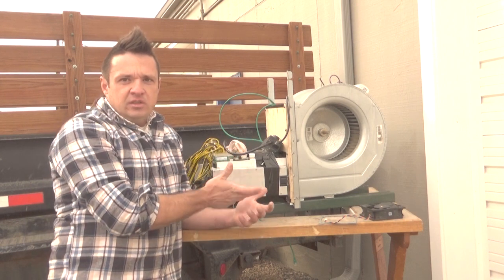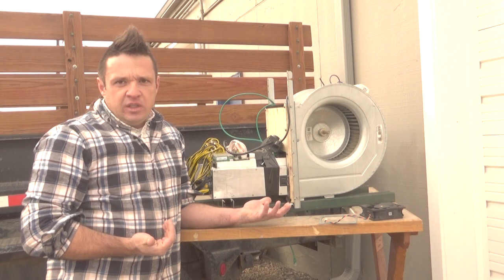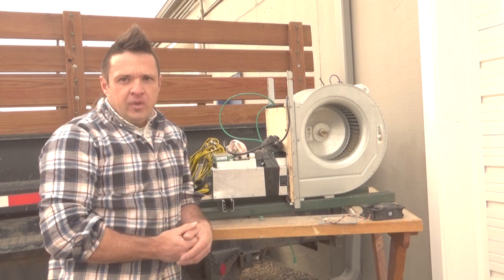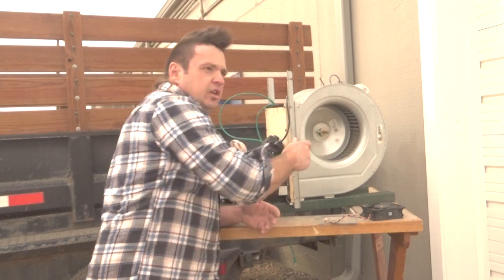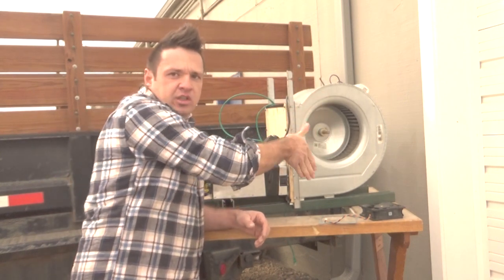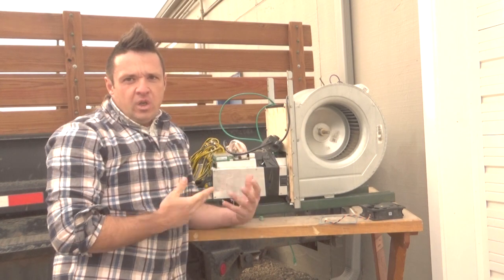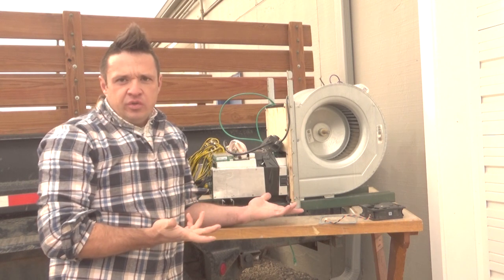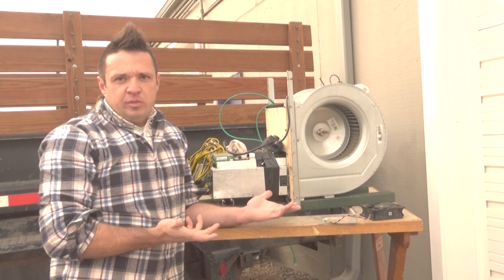Think about mounting a duct — you have to overcome the resistance of that duct to move the air. These kinds of axial fans will not manage that, but the squirrel cage blower will. How this device works is a motor turns the impeller; air goes in through the top, is forced down into the clamshell housing, and comes out through the side. This particular one is a one-third horsepower blower that came out of a common household furnace, and I got it from my friendly recycler at a very reasonable price.